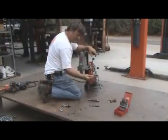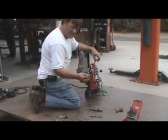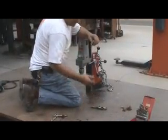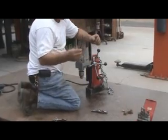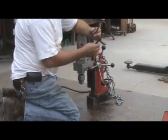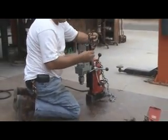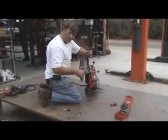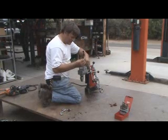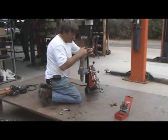So this was my first bit. When you're drilling in really thick steel where you're going to make a big hole, you always start with a small bit to make a pilot hole. And then you come back with the next larger bit — you can jump a few steps — and then you come back with your next bigger bit, and then your finished bit. A good progression from one size to the next. You can cut a hole quickly, but you're not taking this one-inch diameter bit and trying to shove it through an inch and a quarter worth of steel. You just burn up the end of the bit, burn up the drill. That's why you make steps as you go.